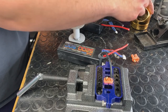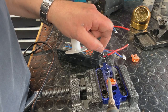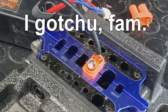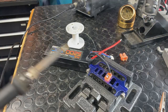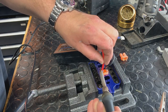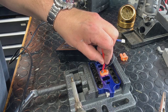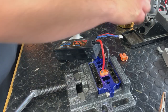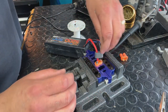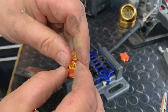Now we've got the positive wire here, so we're going to do the same thing. A little different point — we're going to heat that up, pre-tin the iron a little bit there. Looks good. You can see in there it fills in nice. We're going to heat that up, nice and liquidy, press the positive wire into the terminal. You're going to hear it — it's just going to get melty a little bit. No hissing or anything. And there you go, that's it. The reason we really love this vise with the clamp system — you just simply get it done, not sitting there with two hands. When you look at your connector — frigging pro, man. Looks good, nice and clean.